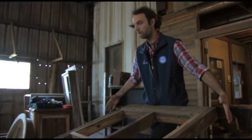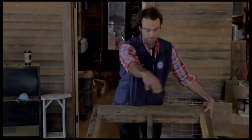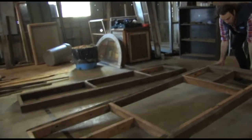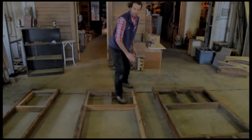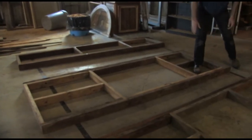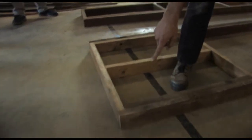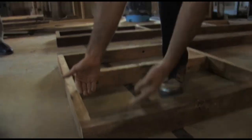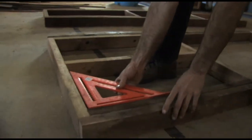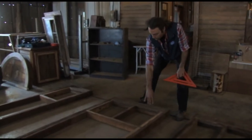We build the headers up ahead of time and then build these boxes as modules. The trick we used is to pick the straightest 2x4 and work off that side. We start at the bottom, along the straightest board, screw the joint up while keeping it square using a speed square to make sure the joint is square, then move to the next joint, all along until one side is completely squared up.